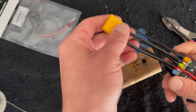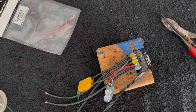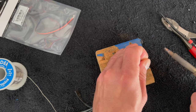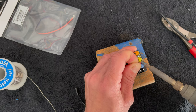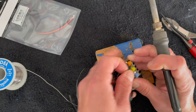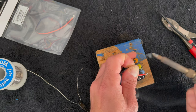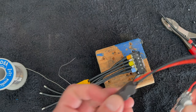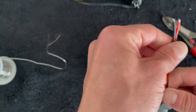Slide the insulator on - now it's ready for almost action. Next we're going to remove the standard power capacitor and install the optional power cap. This is one of those times when I might turn my iron up a little bit more, but I'm going to hit it with a little bit of regular solder and apply it directly. I've got to put it on an angle so I can get some pull - you can feel the iron sink in and you just pull the wire up and out. I leave these wires full length because of where we mount them - I like to have a little bit of extra wire just in case.